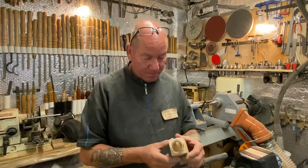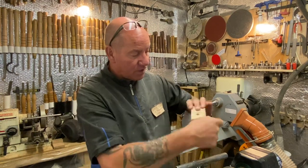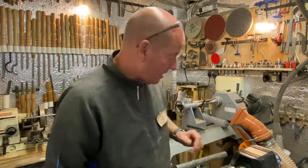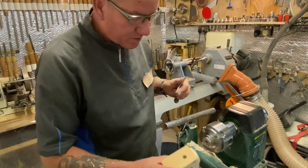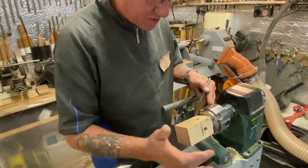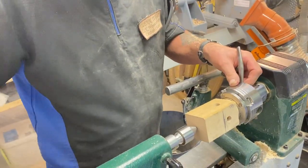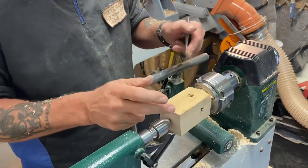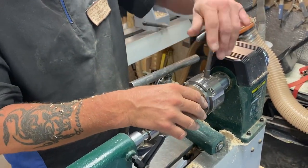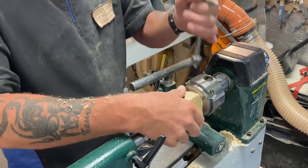I've put a 38mm hole in the bottom, drilled up to roughly about here, and drilled four holes around the side. I'm just mounting that on my chuck — luckily with my jaws closed it's pretty much 38mm fit, so I can hold it internally. I'm putting my tailstock on just to keep everything and stop any vibration because I'm overhanging a little bit.